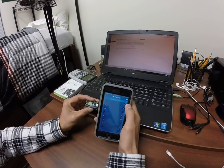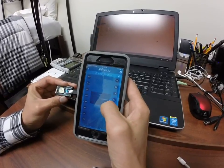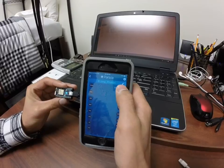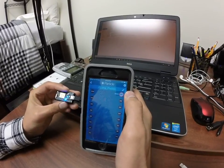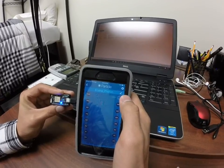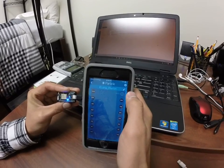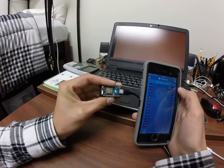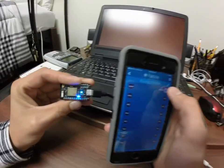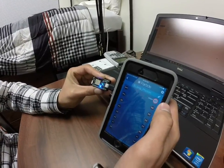We're going to go to D7 and show you how we can toggle that on. We're going to go digital write — it's on low right now, we're going to flip it to high. You'll see this blue LED light up on the D7 pin. Turn it back to low and the LED goes off. High — back on. And there we go, that's it!